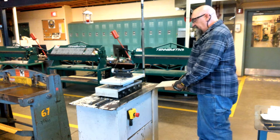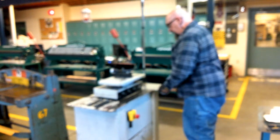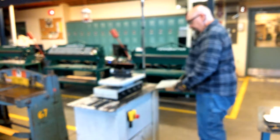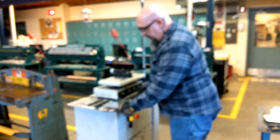Operating the machine, there is a guide bar. We want to make sure our piece of material is straight up against that guide bar and keep it against the guide bar until it's all the way through the machine. Start our machine against the guide bar — it rolls out the ends into a Pittsburgh lock. The machine pretty much does the rest. So that is our Pittsburgh lock seam.